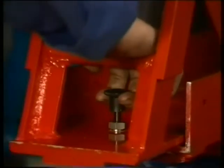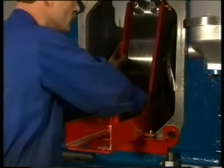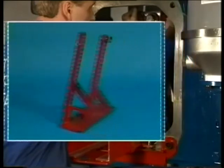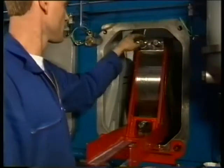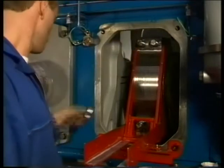Pull up the blocking pin when the carriers are moved inside. Fasten the carrier of the lower bearing cap by turning on the locking pin in the locating hole at one side of the cap. During mounting of these carriers it is possible and sometimes necessary to turn the crankshaft a little bit. Always do this with the manual control of the turning gear device.